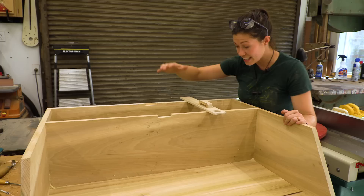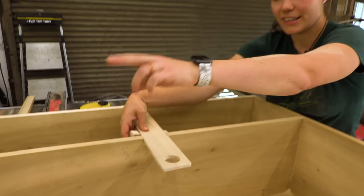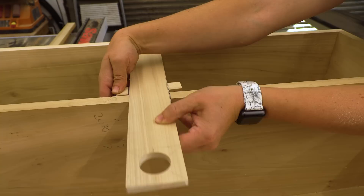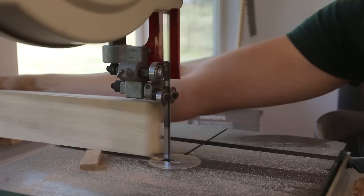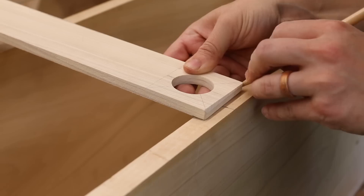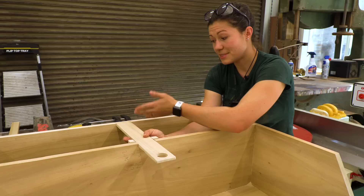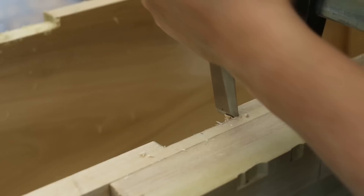My favorite aspect of the Dutch tool chest design is the secret fall front. The front panel gets nailed on, but a little key allows this front panel to fall away and open. The first step was to make the key by resawing a piece of poplar on the bandsaw. I drilled a little finger hole and made the piece that was going to go on the fall front, then rounded off the edges on the sander. Then I had to route the slots in all three places where this is going to find its home. I cut those sides with a handsaw first because I never trust myself with a router on a finished piece already attached to the carcass, then used my palm router to excavate all of the areas that needed waste removed.